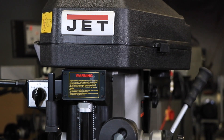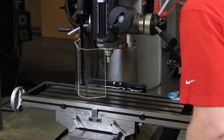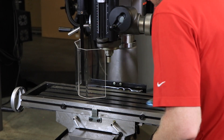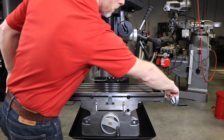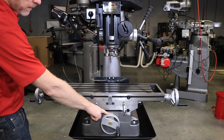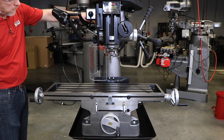Let's begin by going over cleaning and lubrication. For best results, cleaning your Jet Benchtop 18-inch Mill Drill should be a regular shop procedure. Lubricate ball oilers by the XY axis hand wheels, the oiler at the raising and lowering crank handle, and the oiler on the front of the bed once daily with gear oil, heavy-medium. Lubricate the ways once daily with gear oil, heavy-medium.